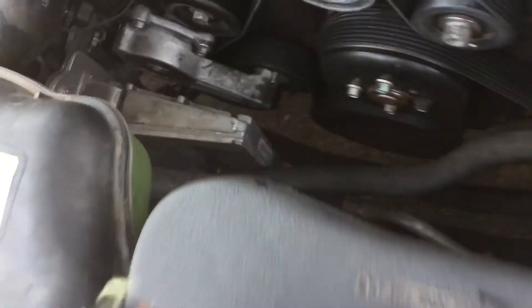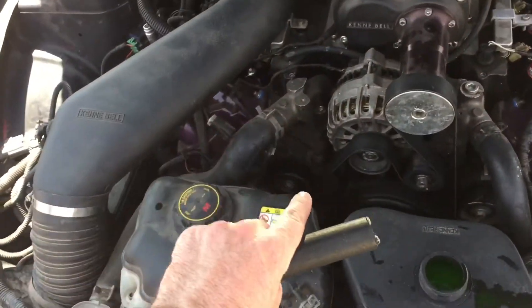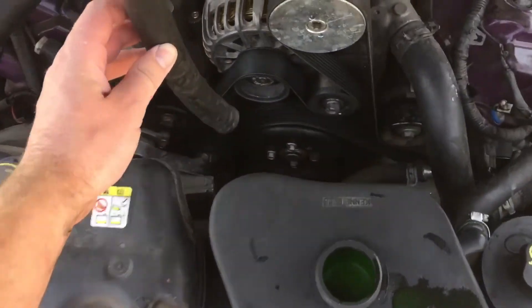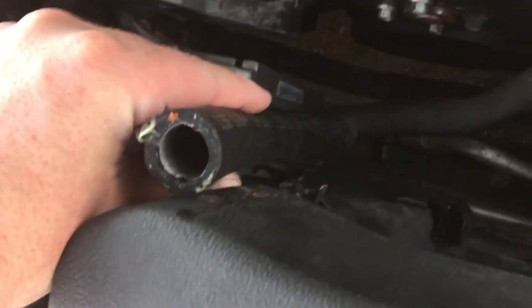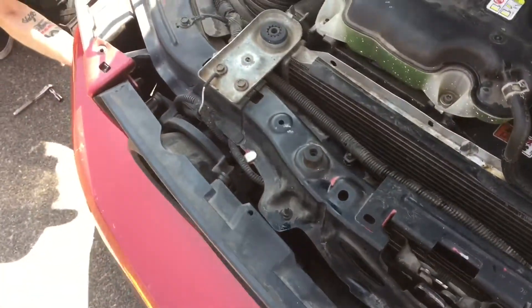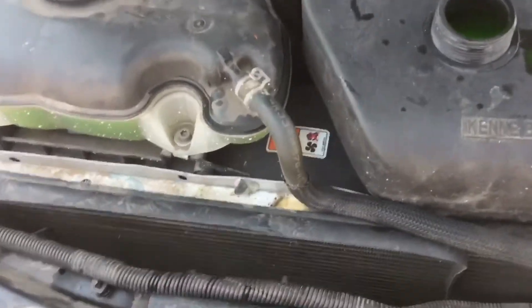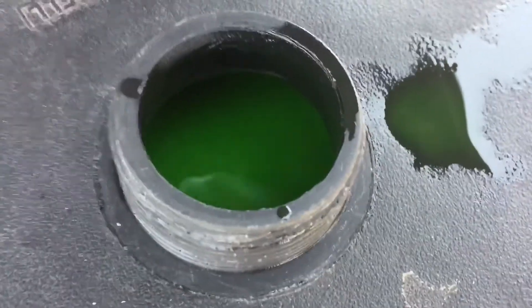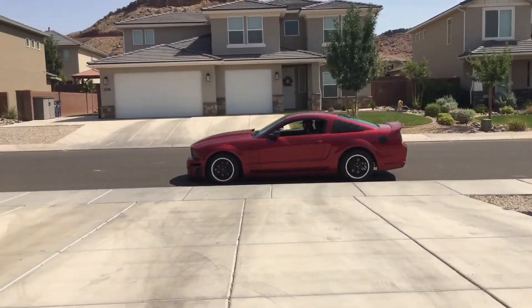We looked at the return line coming to the tank — that looked good. But where it was going down from the expansion tank, it was actually making a loop. These are gravity-fed pumps, and we ended up cutting this whole section of tubing — radiator hose — out of here. You can see how far down that went before we cut it out. That was the problem: the pump had a real hard time pulling that back up. Now it's running because it's gravity-fed. Quick fix.